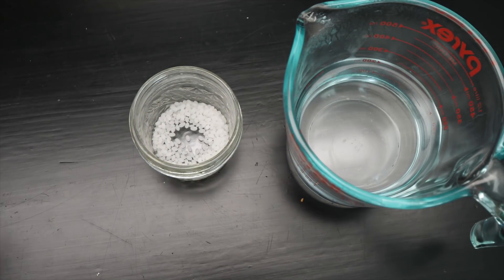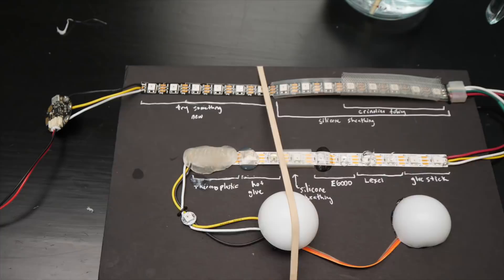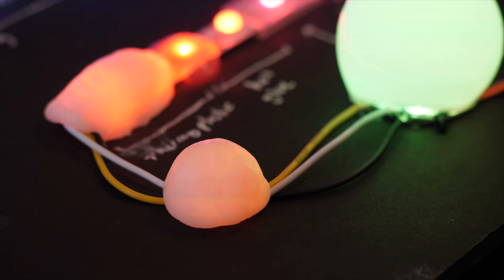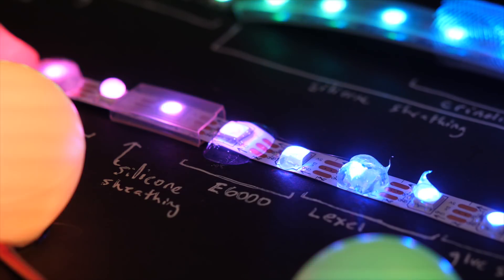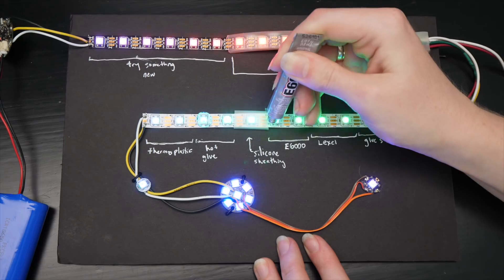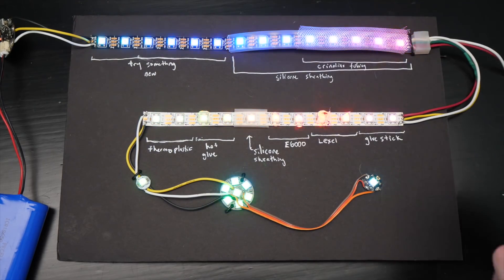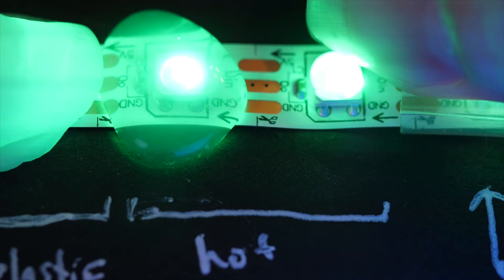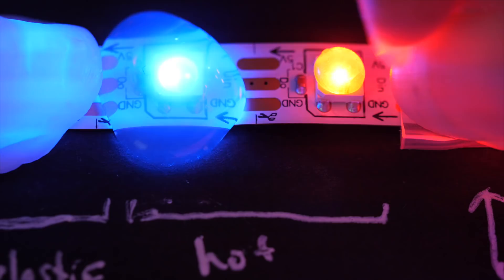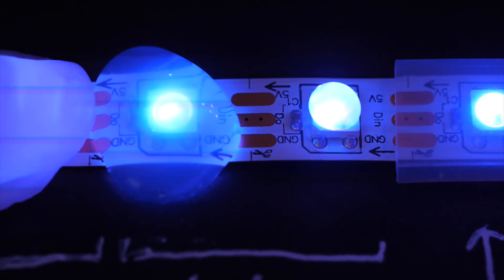Also underutilized in the maker scene, in my opinion, is thermoplastic for diffusing LEDs. This stuff comes in little beads you soak in hot water to make it a pliable dough. It looks great over powerful LEDs, but the more that's on there, the less light will get through, since it's pretty opaque once it sets up. Different glues have different light transmission properties, and it's worthwhile to explore what magic you can make with the adhesives you already have. For this demonstration, I tried out hot glue, E6000, some silicone substitute, and a common household glue stick. I was surprised to find that the tiny glob of hot glue on just the 5050 pixel package itself was durable and not easy to peel off — it gives a wide-angle and pleasant lens effect, and might be my favorite result out of this little testing process.